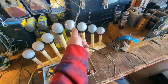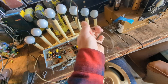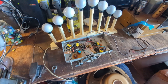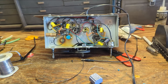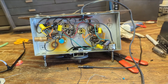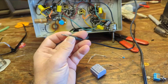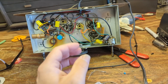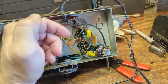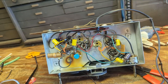Now we can look at this power cord — it's a little stiff, so I'm probably going to replace it. Then we're going to install the audio input feature and resume work on the cabinet before putting it all back together. I just got back from a 15-mile bicycle trip — it's going to be Thanksgiving tomorrow, so I figured I need to pre-work some of that off. Now it's time to put in the audio input, which means running a 3.5 millimeter stereo cable into the set's volume control so we can moderate the volume of the incoming signal.